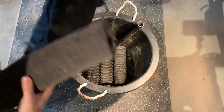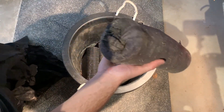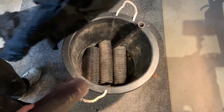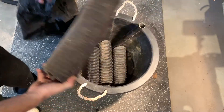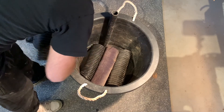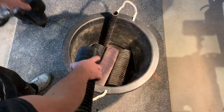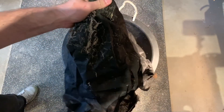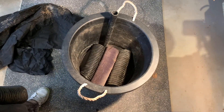Another alternative to this mesh, if you can't find any at Lowe's or Home Depot, is to wrap your corrugated piping in a filter sock. Instead of having three uncovered pipes and mesh, you wrap the pipes in the filter sock — it'll still give you the same result. If you can't find your mesh, wrapping the corrugated pipe in a filter sock works just as well.